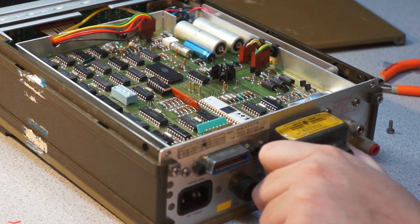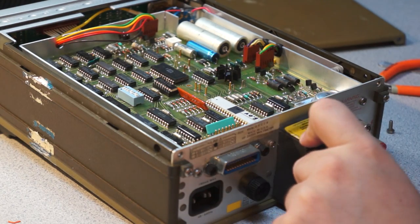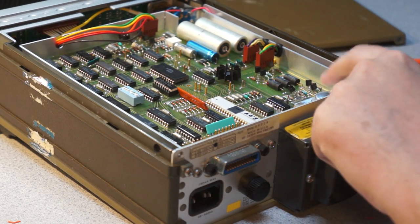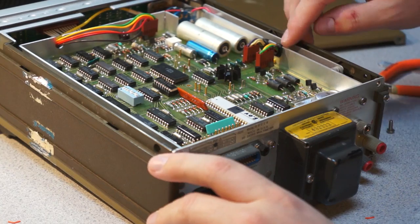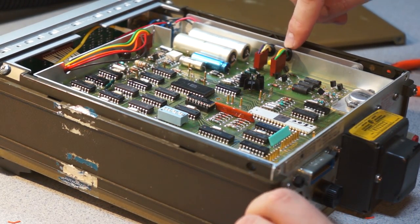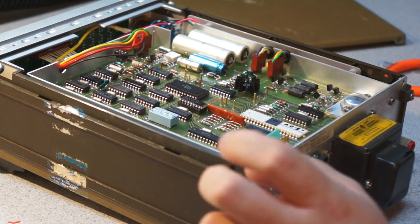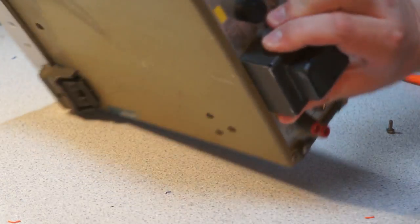You can see we've got a number of interesting little devices in here. Resistive elements, a big ceramic ASIC. That's probably like an HPIB controller. Various things. There's a big TO-3 device here. Some interesting stuff going on. You can see the construction of this is just wonderful. They had to feed these cables through here, so they put little grommets in these insets, and it looks like the one up here fell off. Here you can see the big front rear panel switch. And it seems like this is kind of a double-sided instrument.